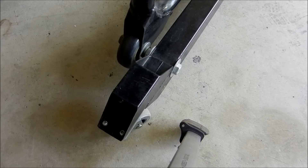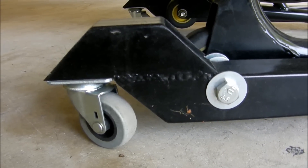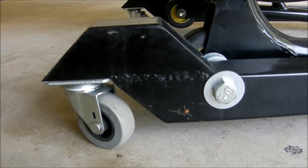The paddock stand still pivots from the wheel like it normally would. The longer bolts I attached to the yoke frame, which is just a Y shape. Rather than the stand sitting on the ground, it sits on three trolley casters. This is the front caster mount, and as you can see, because of the way I put the frame together, the top of the caster sits at the top of the frame.